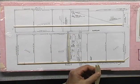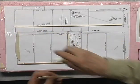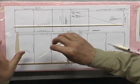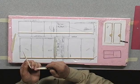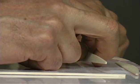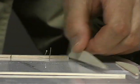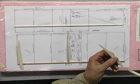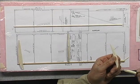Then let's do the end ribs. Now these you do want to double glue, so let's get that started. Let's use this one here. Get a little bit of glue on the front and side. That's going to be touching that joint there, like that. And then we're going to lay that down. Do the other side, just a little bit to get it wet.